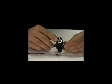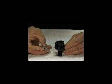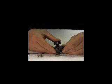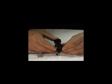The main spring will still be in the body. Pull the spring from the body and look for any shims that might be stuck on the bottom. Because Ninja Paintball regs are handcrafted, the amount of shims may vary from reg to reg. However, all regs will have shims to adjust the pressure. Ninja regs are set up to output 800 psi. This pressure should be appropriate for all markers.